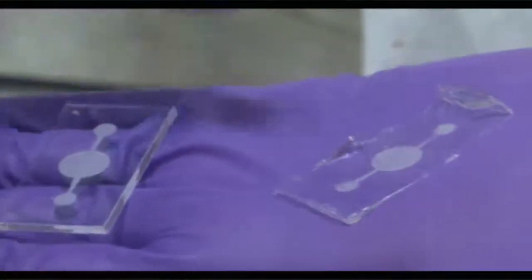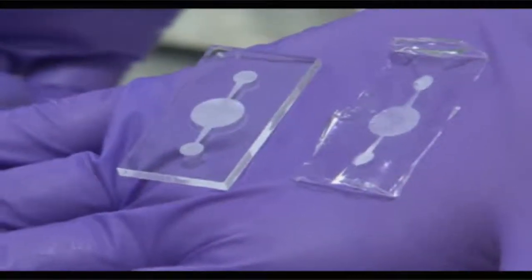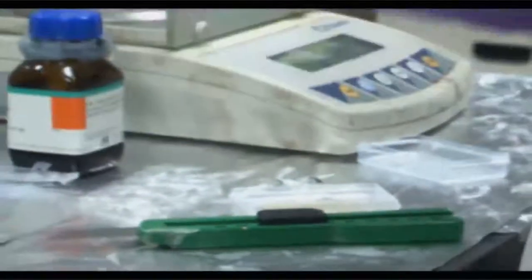This ridge is now being further replicated in another layer, and that is why this process is called micro replication by double inversion. The first layer is the PMMA, which is the channel. The replicated layer is the ridge, and this ridge is again replicated into a channel by using this ridge pattern on the PDMS after solidifying and heat curing the PDMS for some time. So we are inverting the pattern once, building a negative pattern on the PDMS intermediate, and then in the next step bringing another inversion of the pattern, so we are essentially replicating a channel onto that surface.